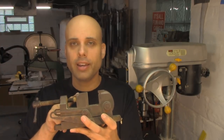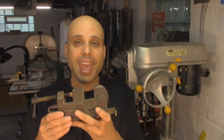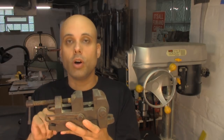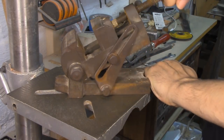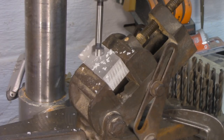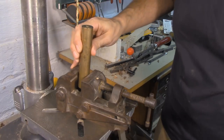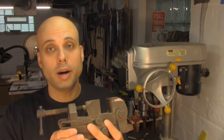For heavier or more complicated work, I recommend one of these heavy-duty drill press vises. These aren't super easy to find new — I'll link to something similar in the description — but if you can find one used, they're not very expensive and they're super useful. They're much heavier than those light-duty vises and have nice attachment points for bolts on either side. This one is also a tilting vise: undo a couple of bolts and the whole thing tilts up to 90 degrees. This is much easier than tilting the drill press table, and you have your work holding and tilting combined. These vises also tend to have V-grooves in one of the jaws, which allows you to hold round stock either vertically or horizontally and grip it really securely.